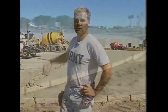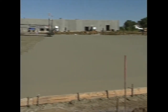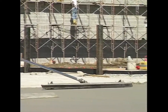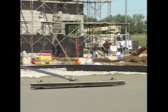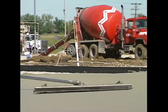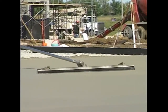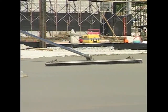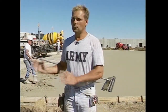What we're doing here is paving a 130-foot wide by 200-foot deep section with a laser screed. If you try to broom that wide, you end up with maybe four or five loads that aren't ready at the same time. This way it enables us to just keep coming with the loads so they're all brooming at about the same time they're laying on the ground — we're getting a much more even, flatter finish, and it's a whole lot simpler. It's saving us time and one man in the brooming operation, and we're finishing right about dark when we're done.